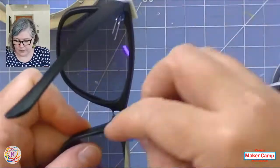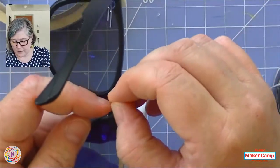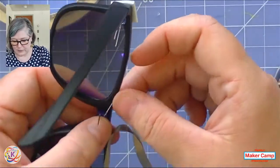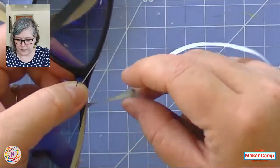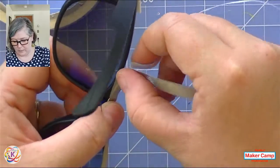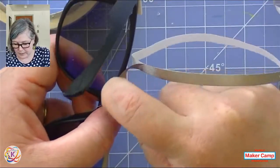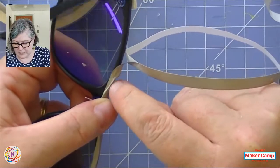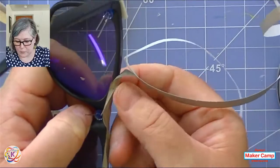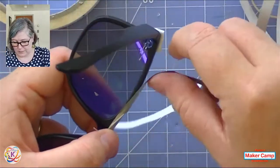Okay. Our next one, making sure it fits in, making sure we've got the positive lead on top. Again, I'm just going to kind of fold that on over gently with these, hold that in place with my fingers, and come over with my maker tape. Okay, and again, just making sure I really press that along, make sure my lead is in really good contact. That's where these tend to go wrong, if you don't get really good contact with your LEDs and the maker tape. And then we're going to come along the top again.